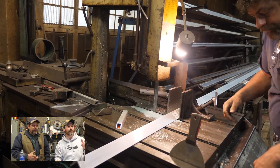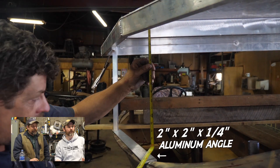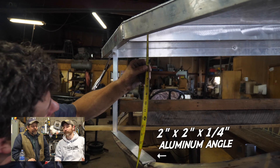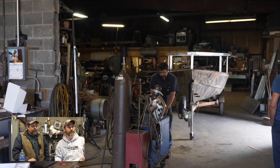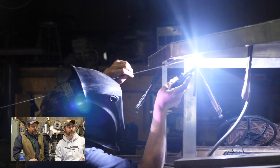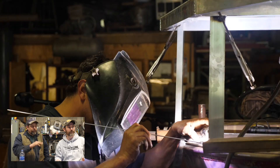Here we've got two-by-two aluminum angle that we put on the inside of the boat at an angle, so when the deck sits on there it's already rigid. We clamp it later on just so it couldn't jump off the boat. This way we didn't have to bolt it to the boat — we just used a couple of hand clamps and it holds it secure even going down wavy water, jumping up and down on the waves.